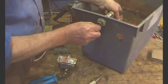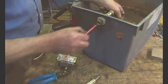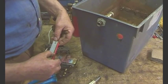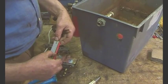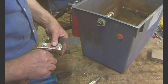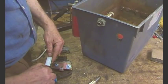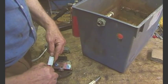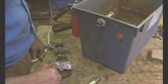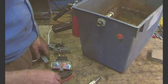How long does the push rod have to be? So let's go for when it's about the right position - that is 65mm, or about two and a half inches. And it's going to thread on there, so we're going to take a quarter of an inch off. And that is 25mm, or about an inch. So 65mm and 25mm is 90mm, minus about a quarter of an inch - 80mm. So the push rod needs to be about 80mm.